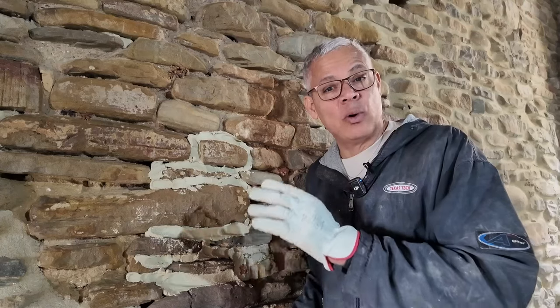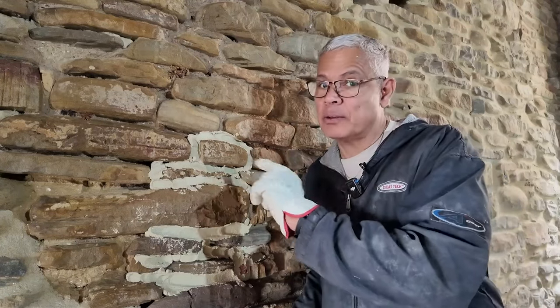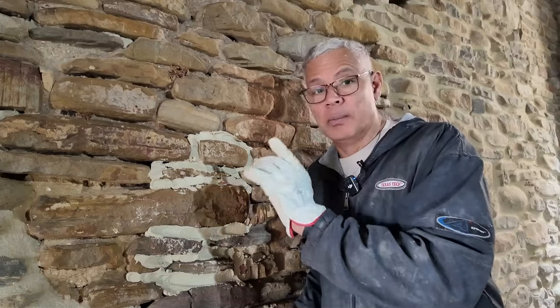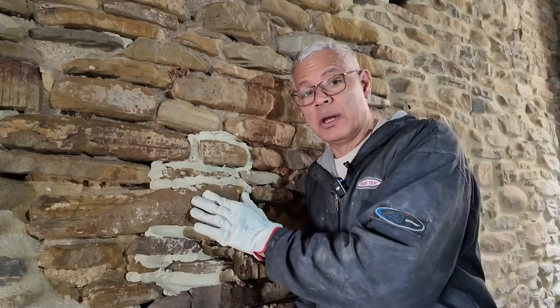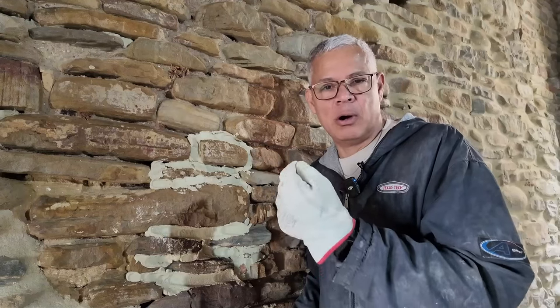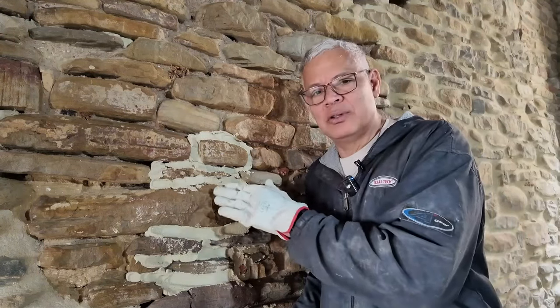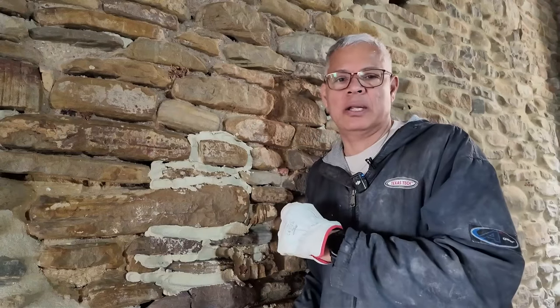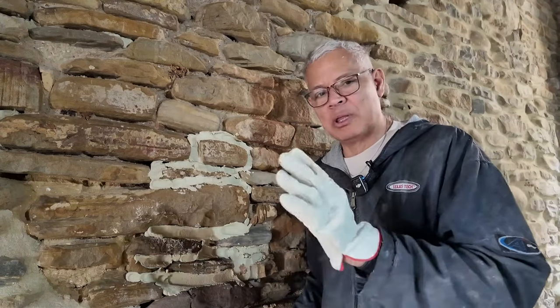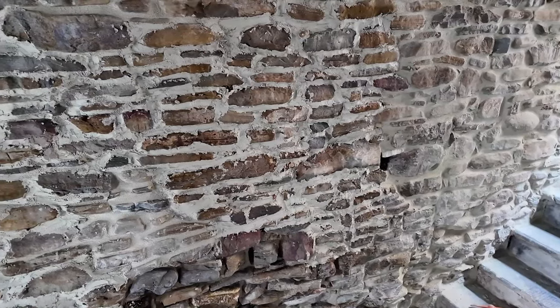The walls in this house are primarily stone, but there are areas where I find brick. And in those areas, I have to be careful because I inject the mortar and I need to go back a lot sooner than when I'm working with the stone, or it's gonna dry. And as it starts to dry, it starts to become kind of a hard, sandy texture, and it doesn't get down into the crevice when I push it. I have to really push it hard to get it in there, okay? So just something to keep in mind. Okay, hopefully you can see this.